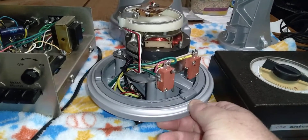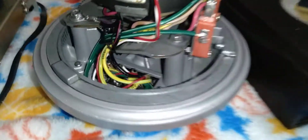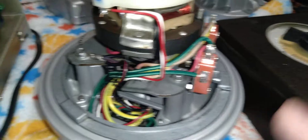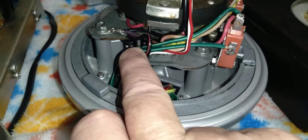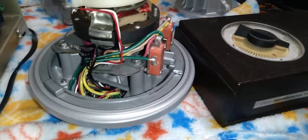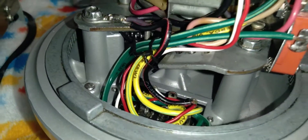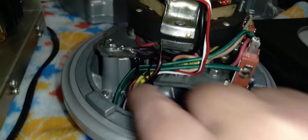Things in the rotor assembly I didn't want to do but had to do, and I really feel bad about it. The point system that fired the solenoid in here, I had to take it out. There's a gear that rides on that shaft that had the cam that actually closed the points to fire that solenoid to make it in time. I didn't want to do it, but I was afraid the gear would get into the wires and cut them and chafe them. So I hope I did pretty good.